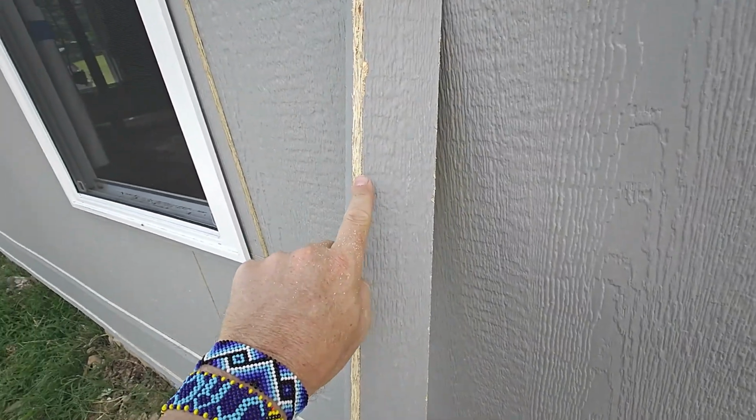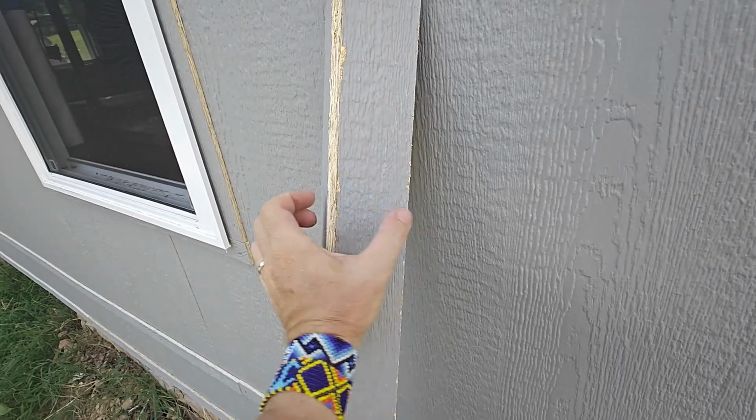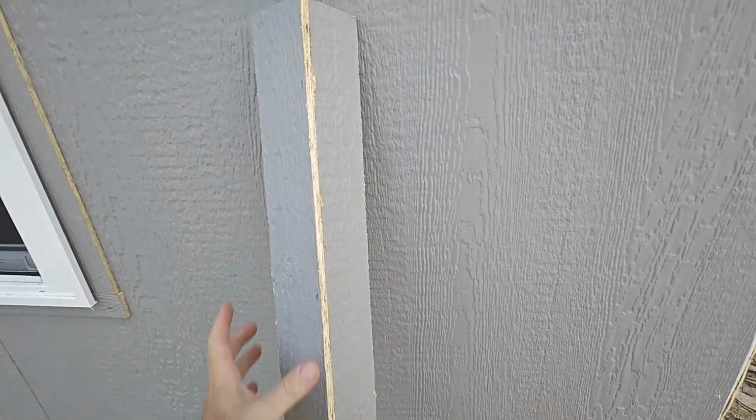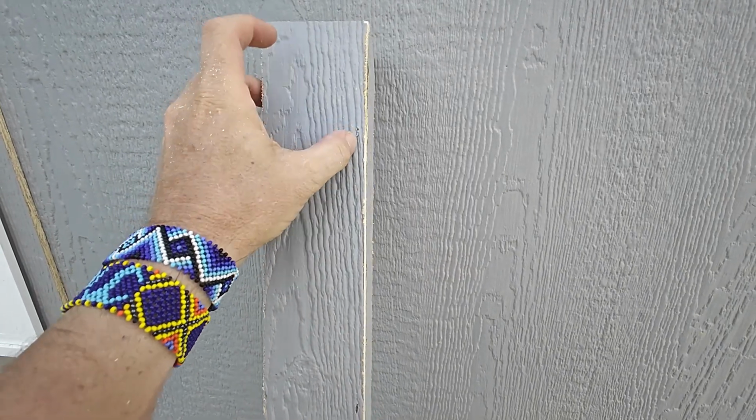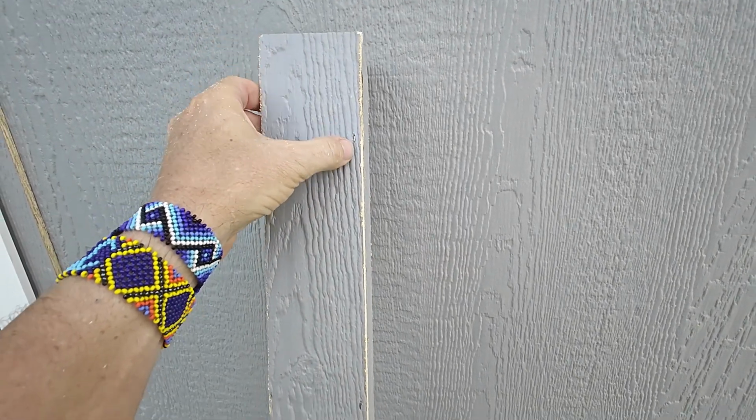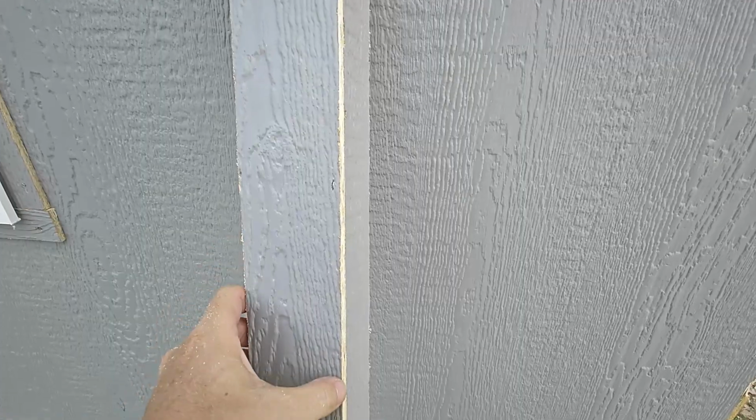And when you take the 2 1/2 and then add the thickness of the material, you get 2 7/8 on both of these. And then I just took my crown stapler, which has really small but long staples, and I stapled these two pieces together into one. And so that's what I'm going to do on all these corners.